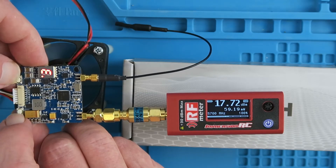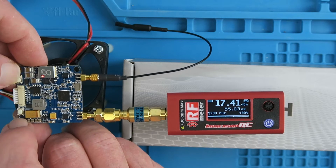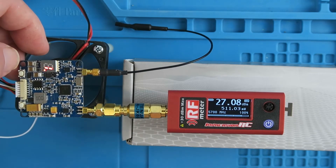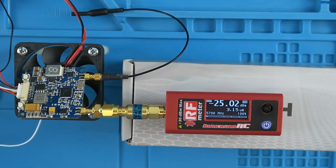To change the power level, we need to press both buttons simultaneously, then step up to the next level — indicated by two dots flashing — which should be our 300 milliwatts. We'll turn off and let the thing cool down since the power meter has been on for a while. Switching on again at the 300 milliwatt level, we can see it confirmed at 300 milliwatts, now drawing 0.86 of an amp.